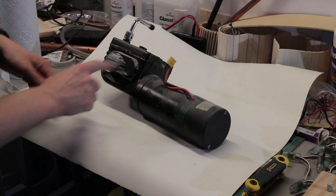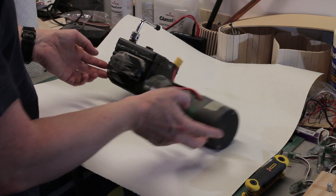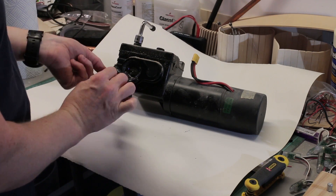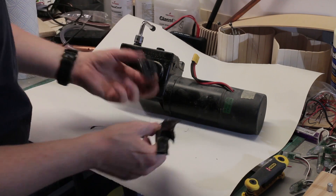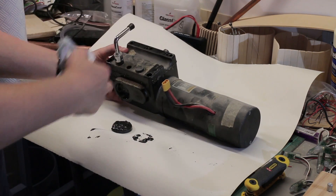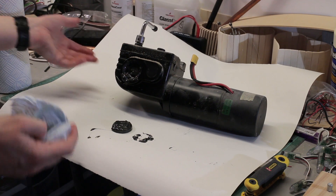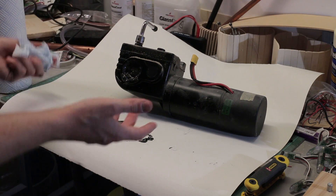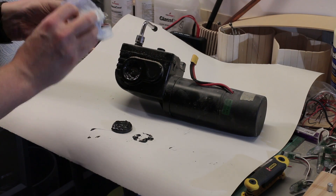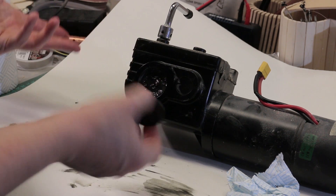So this is the main motor. As you can see I've taped up something here to stop something falling out, so I'm going to try and peel this back and see what's going on. There seems to be some kind of plug that came out that must have been taped back into place. Looking at it, this motor must be a dual-sided one, so the same fitting is on both sides. Then depending on its use case — left or right — one side is plugged up. Why this plug came out in the first place is hard to say; I need to get it back in and sealed up. I've cleaned up this plug and pushed some of the grease back away from the edges, so I'm going to try and force it back in place.